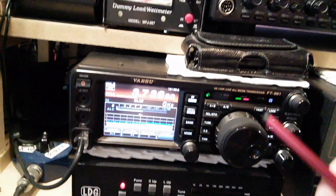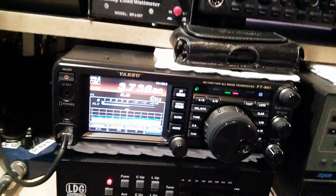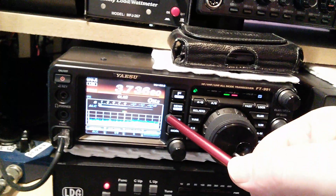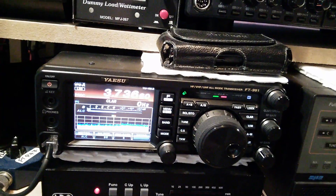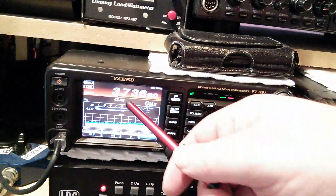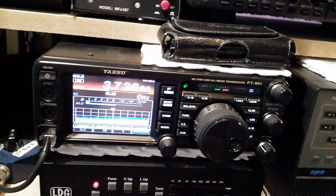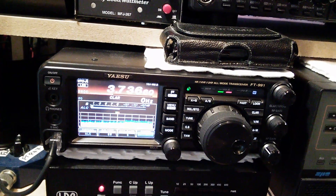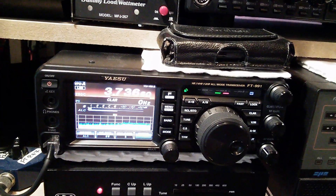Press escape straight back out - have it on auto all the time. So you've got your ALC out the back of the 991 into the back of the BLA350, and your amplifier straight out the back of the tuner and then straight into the back of the BLA350 and you're up and running. Just keep an eye on the ALC, make sure it's only about 9. You know how to set it up because I've just showed you. Any more problems just post below or send me another email. Alright then Mark, hope you enjoy the radio and the BLA350. Catch you later mate. M0AOV.